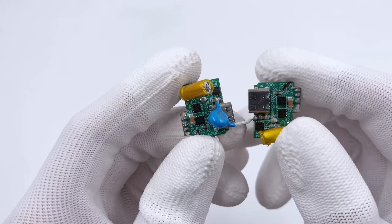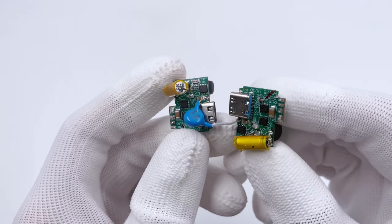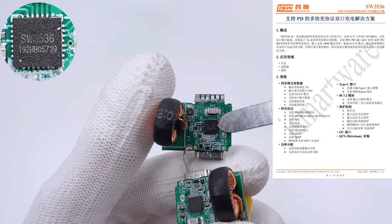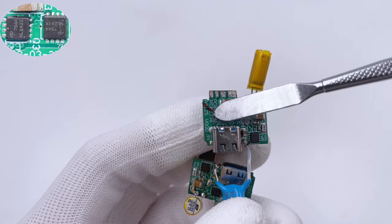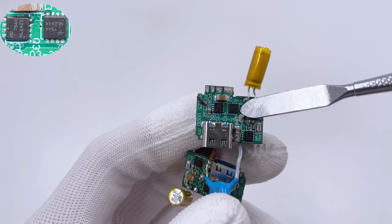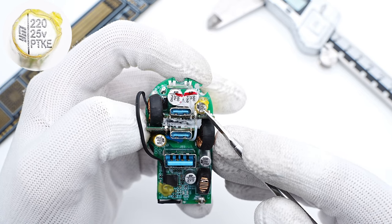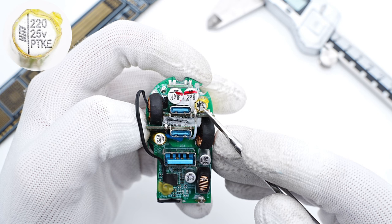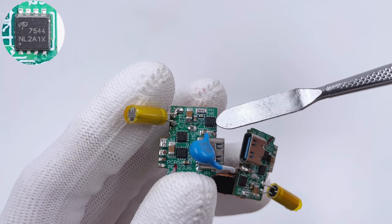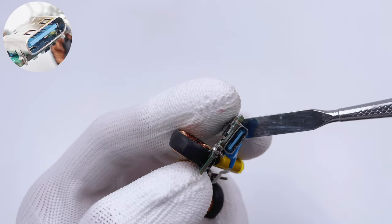Those two small output PCBs are exactly the same. The buck MOSFET, USB-C connector, and output filter capacitor are on the front. The buck inductor and charging chip are on the back. This is a highly integrated multi-protocol charging chip from iSmartWare, used for buck output. The two buck MOSFETs are from AOS, adopting DFN 3×3 package, rated 30V/4.1mΩ. The buck inductor is insulated with heat shrinkable tube. The solid capacitor for output filtering is from Yongming MPT series, insulated with heat-resistant tape, 220μF/25V. The output VBUS MOSFET is the same model as the buck MOSFET but with different functions. A bypass capacitor is connected between two USB-C connectors, and the USB-C connector is Anker Blue.